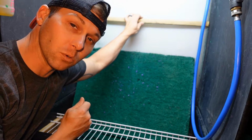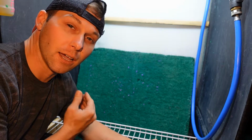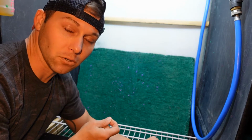from the same piece of wood, about 1 inch wide, that runs the length of it, and what I do is I squeeze a multi-purpose air filter in behind it, and what that does is that it will catch any water particles that went through the screen. I don't want it coming back, and I don't want it making a mess anywhere outside of my washout booth. I also have the same filter in the bottom of my washout booth to catch any debris that doesn't need to go in the drains and cause me further issues down the road.